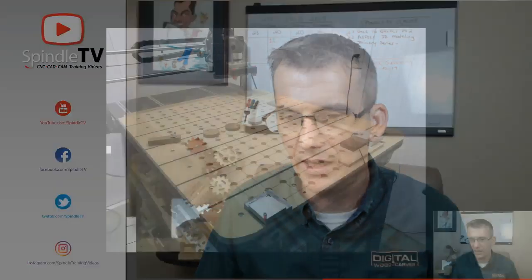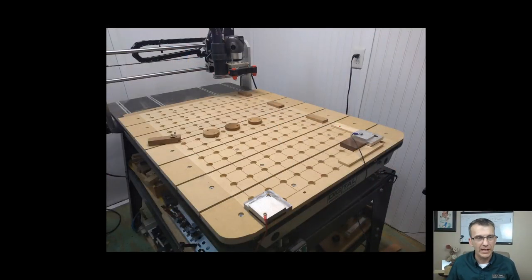So I've got two of these that you'll see in the picture here, and those are my two main fences. They'll never get moved. That creates my XY zero position, that 90 degree point basically. And then I have my smaller fences that I can stick in various slats down the length, and that gives me a reference fence all the way down that X minus side of my table. From there, I've got cams and mechanical clamps and all that stuff that we can do.